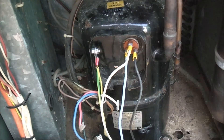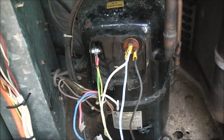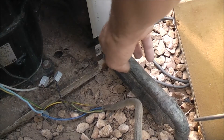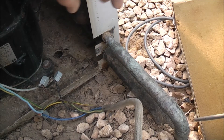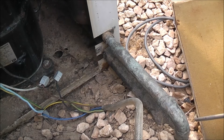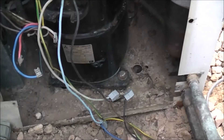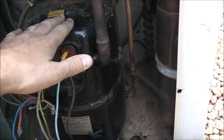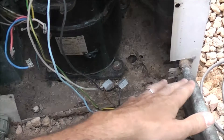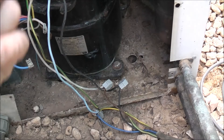There's your charging valve there — that's where you charge the system with refrigerant. This is an R22 system. These older units would have been empty with inert gas or nitrogen in them. You'd solder your pipe racks on, take the caps off, put everything together, then pump the vacuum. The whole thing would be under a vacuum, and then you'd charge here with your refrigerant. These newer systems come pre-charged with refrigerant — you just put your line set on, evacuate with an air vacuum pump, then open up the valves and the refrigerant goes to the indoor unit.